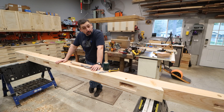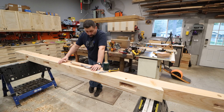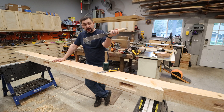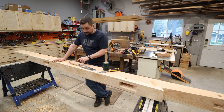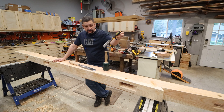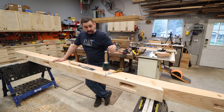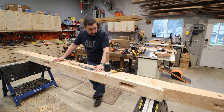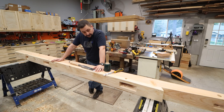This is going to wrap up the major mortise and tenon work for the garden shed. All the posts and beams, tie beams, and scarf joints are all complete. I was able to do that here in my heated shop in the winter time. I'm going to wait for a little nicer weather to start assembly of the building. We are going to begin working on some of the girts and some of the rafters, but for now we have wrapped up the mortise and tenon work. A couple of quick tips: a two inch wide timber framing chisel is an absolute must — this happens to be a Robert Sorby, I can't recommend it enough. A one inch or smaller chisel that you can pound on is also an absolute must. And one of these Wood Is Good mallets — this is a 30 ounce mallet — that is an absolute must when you're timber framing this way.